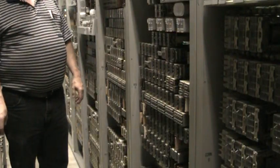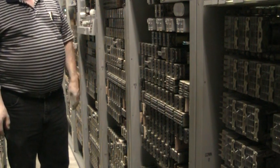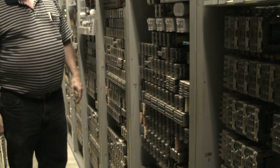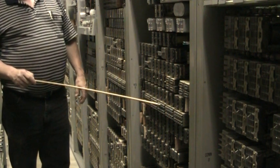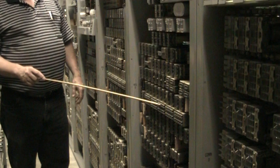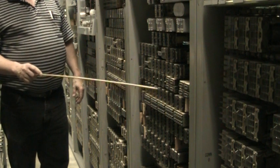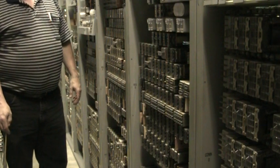When a subscriber requests dial tone, they go off hook. There's a line relay, of course, like in a step-by-step system. The line equipment requests that the marker set up a call to what's called an originating register. The originating register is what provides the dial tone towards the calling subscriber, it records the digits that they have dialed in either touch tone or dial pulse. And at the end of 7 or 10 digits, then the register requests that the marker come in and look at the information and then act on it accordingly.